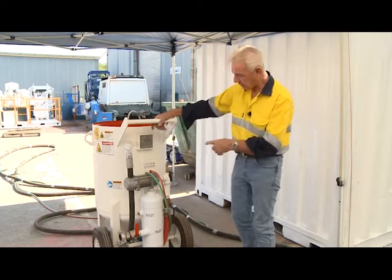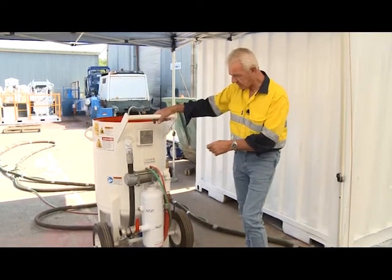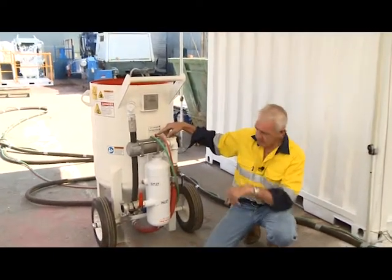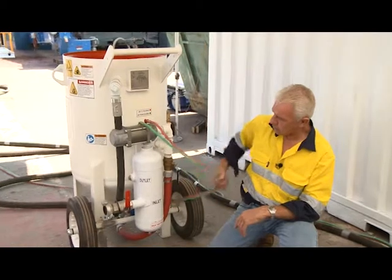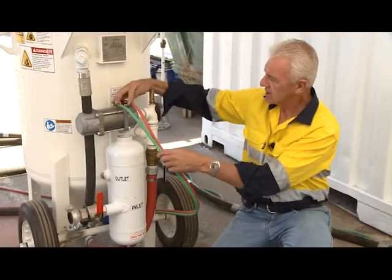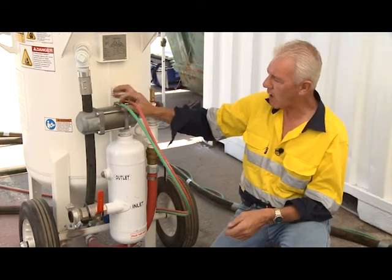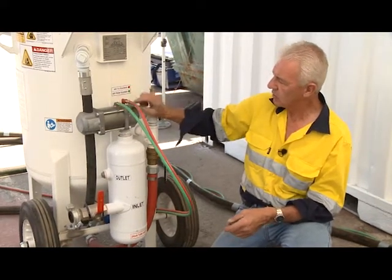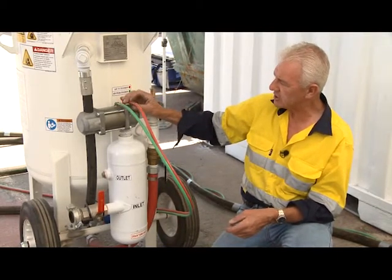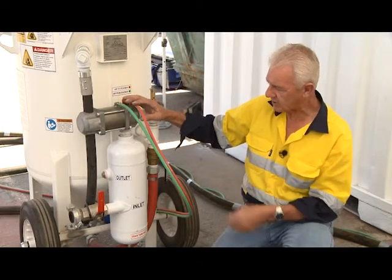This blast pot is a 6.5 cubic foot pot. This is what we call a micro combo valve system. The combo valve is at the top and you can see two lines running into it. Those two lines are the dead man lines, called twin lines. You have one which is quarter inch and one which is eighth inch. The bigger one, or the red one, is always the signal line — that's the one that has positive air all the time and tells the rest of it what to do.